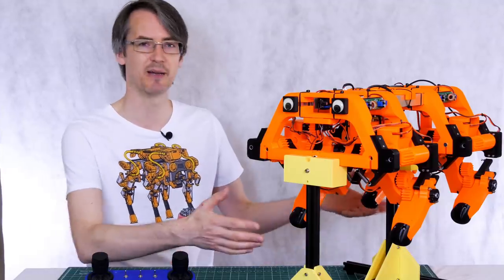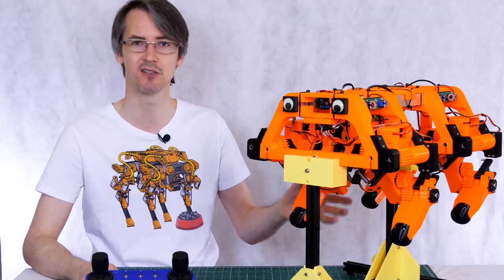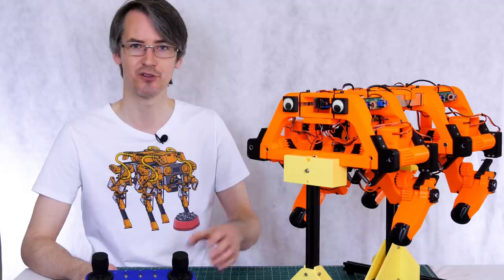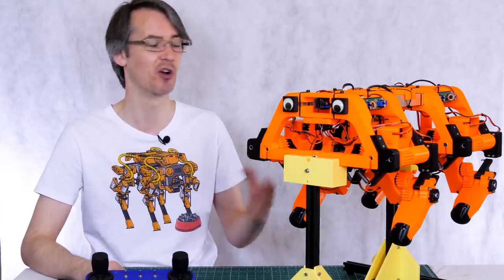And you'll notice the feet slipping on the ground a bit there, as it did with the previous version, and that's because the servos run to their end stops and some of the legs can't get longer or shorter enough for extreme moves combining some of those axes at once, and so the math is right but the robot's wrong.